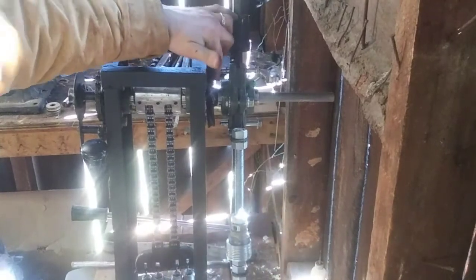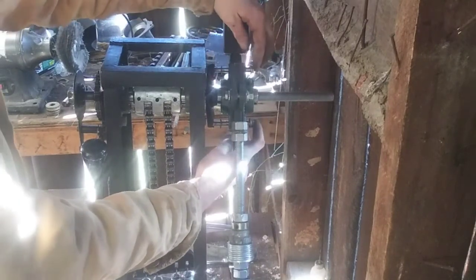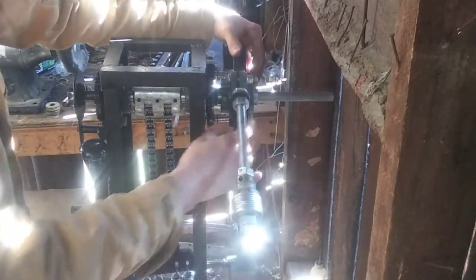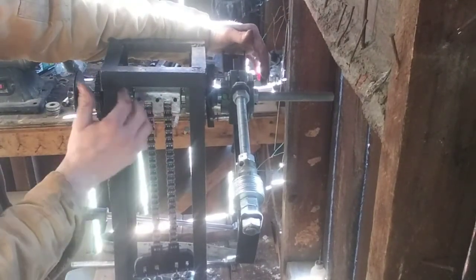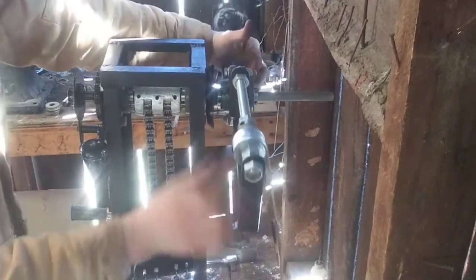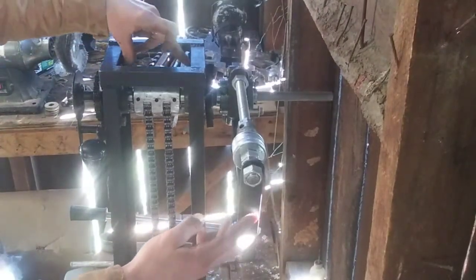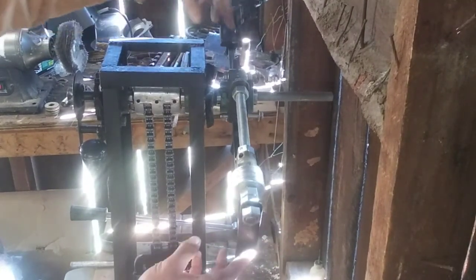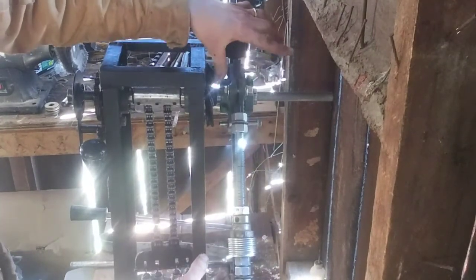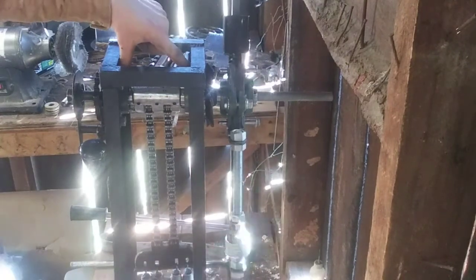So this fan gear has six blades on it. And these two pins right here, I call the firing pins, because this is what allows all of the energy from your machine, and we'll get to the energy source here in a little bit, all of the energy from your machine is going to go through these firing pins and actually allow this arm to turn as fast as this shaft. Next we have two pillow block bearings on the inside of the machine. You probably can't see them very well, but they're just like these two right here. These are two mounted opposite, facing away from each other, bolted together, and they have those firing pins going through two of the holes in the side. There's two more just like that right here.